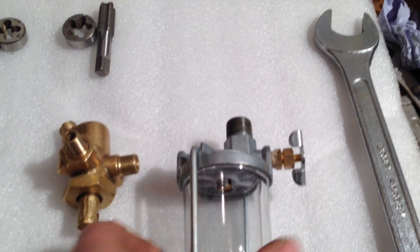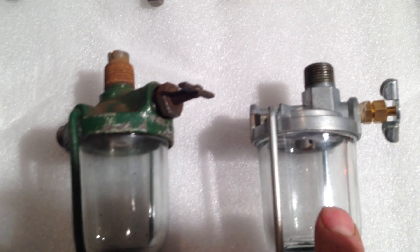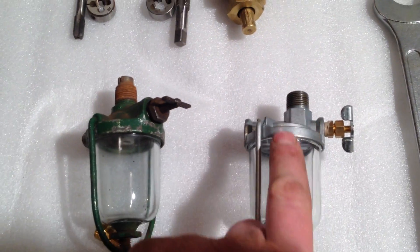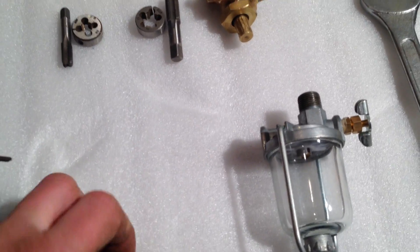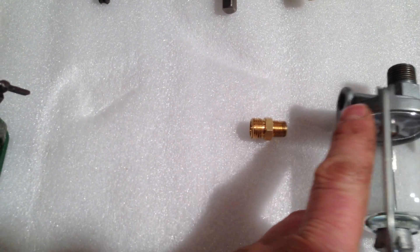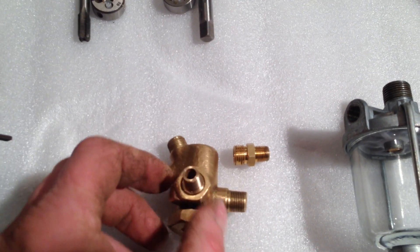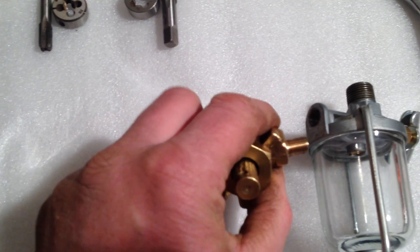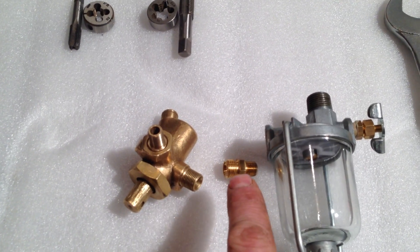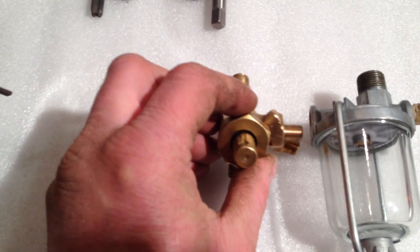The problem you have with these modern bowls is that the inlet is offset to the side, whereas on the original the inlet is more or less central with the main unit. On these ones the inlet's offset. So when you buy them, you've got to buy a fitting which screws into this end here, and then you screw your three-way valve onto that fitting. The problem is, when you screw this onto the bottom of the tank, everything is pushed out so you get interference with the side of your hood because you can't get it pushed right in.